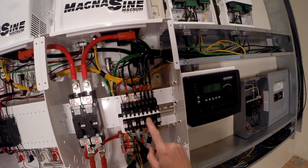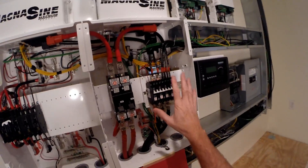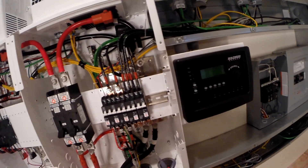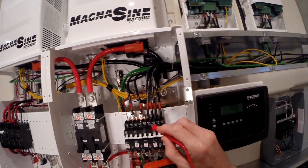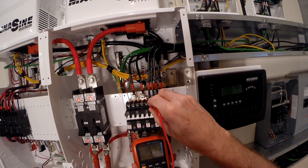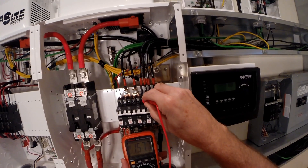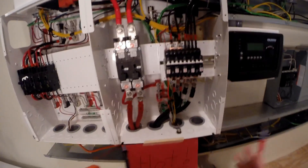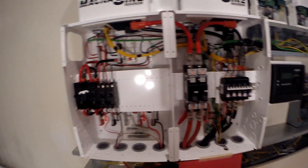This is the battery monitor kit on a 2-amp breaker. This is the 100-amp output of the first charge controller, and the 100-amp output of the second charge controller, then the input to each charge controller. None of this stuff is turned on yet, but there is power coming from the solar bank — 157 volts and dropping because the sun's going down and it's in the shade. I wanted to do this while it's in the shade so there's not a lot of power coming in.